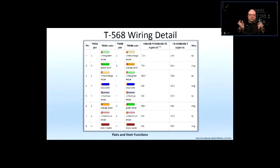What you need to do is connect the transmit pair from one side into a receive pair on the other side, and the same the other way. So then you have to use a crossover cable because of that. Now we are switching green and orange pairs for the crossover, and that only works for Cat5e, because in Cat5e only two pairs are being used. So we are leaving the other pairs alone, unswitched, which would be the blue pair and the brown pair.